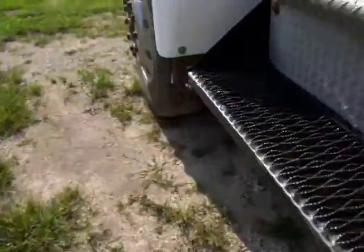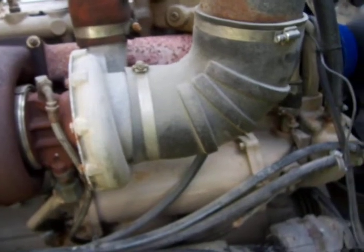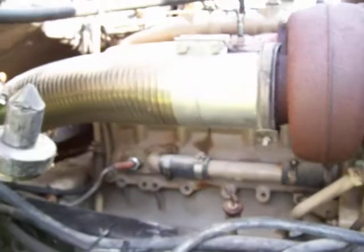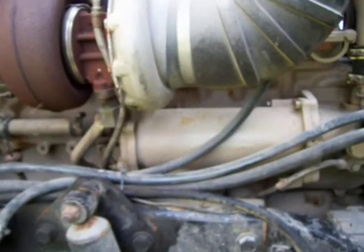Yeah, 290. Big cam 290. It's a big cam 1, 1979. They still don't look too bad. Yeah, we put a new turbo on it, piston sleeves, bearings, almost 2 years ago. Ain't leaking too bad. Yeah, it had basically melted a piston. The firing gets past your rings and basically just starts eating on the piston about like a torch.